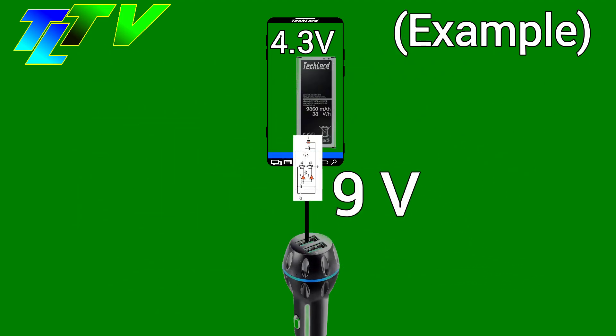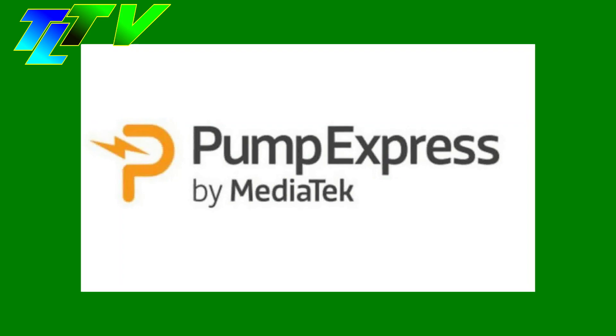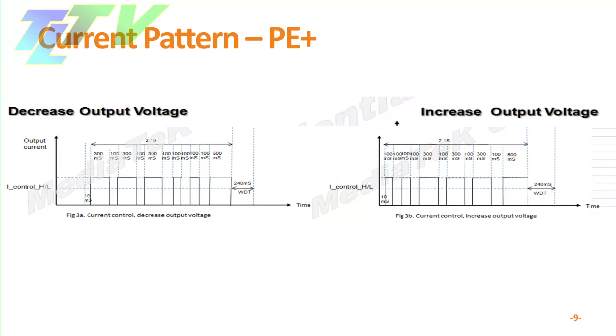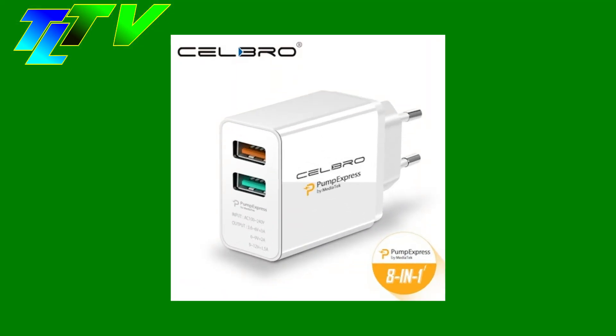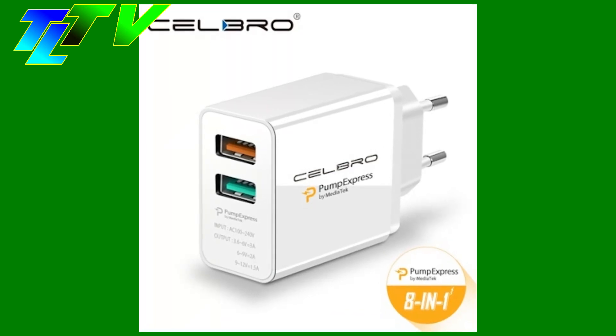The two early standards for requesting an elevated voltage from the power supply were Qualcomm Quick Charging and MediaTek Pump Express. While Qualcomm's protocol communicates to the charger utilizing the USB data lanes, the original version of MediaTek Pump Express utilized the main power lines themselves for communication, by toggling the current draw in specific intervals representing information interpreted by the power supply — also known as current modulation.